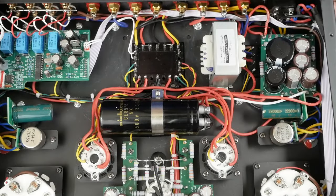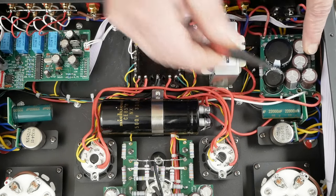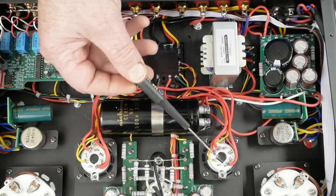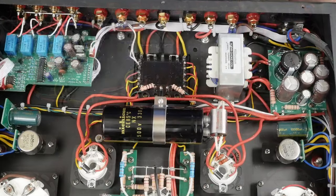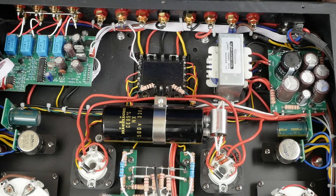We're going to look at this early version of the R300 — I've seen several variations. I've seen one where this board looks very similar but has an extra capacitor up front. I've seen them where they have one diode in the delay board, and I've seen where they have two diodes in the delay board. So there are a lot of variations, but in my opinion there are two major revisions. Originally on one forum we were trying to label them A, B, and C, but I think the simpler thing is there's an early and a late version.